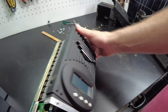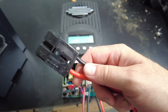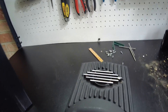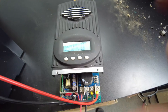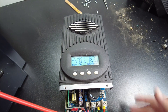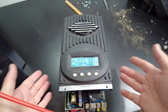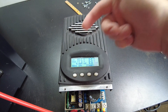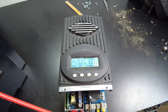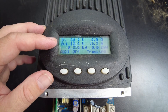That's as far as I'm going to tear it down, but I did fire it up and it does indeed work. I'm going to hook it up to this Felicity battery box here, and it powers up. In case you didn't know, to reset this device — if you want to change the voltage or just reset it to default — you hold these two buttons and then power the unit up and it'll start fresh. Then you can select 12, 24, 36, 48, and I think 60 volt. Let's plug in some solar. We don't have a lot of sun out today unfortunately, but there we go — it's tracking.